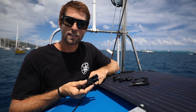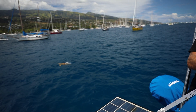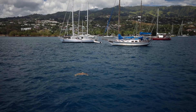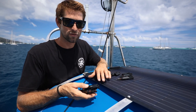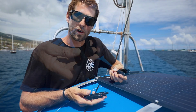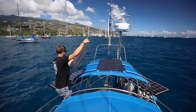Now the center panel is installed and ready for wiring. We love the idea of branch connectors for connecting solar panels — they make it quick, easy, and highly water resistant. Quick break — turtle! One of the highlights of doing install videos in Tahiti is you take a break when the turtles pass. The only downside is when you start connecting multiple panels — three up to four panels for these flexible ones — the connectors start getting really bulky and trying to find a good spot to hide them is a little tricky. One of the advantages of the aluminum frame is it gives us a little space between the fabric and the panel to be able to hide these.